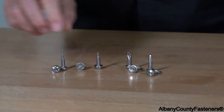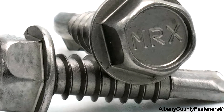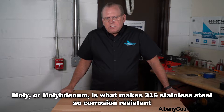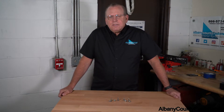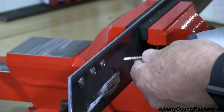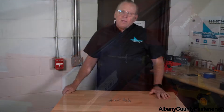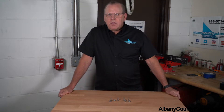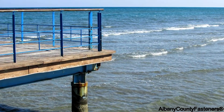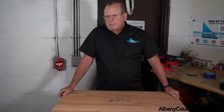Ultra stainless steel — I tried ultra stainless steel. It doesn't have a grade; however, it's a mixture of 410 stainless with moly added in. This prevents corrosion in a very harsh environment. Most stainless steel self-drilling screws are made from 410 stainless steel, which sacrifices corrosion resistance for the hardness needed to penetrate steel and metals. This can cause issues for areas prone to high corrosion, such as job sites near saltwater or docks. If you have a deck in those areas, same thing. Ultra stainless steel fixes this problem and gives back what 410 stainless steel lost.